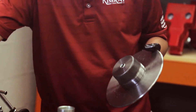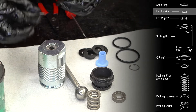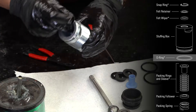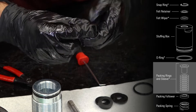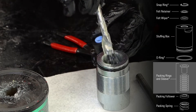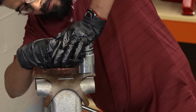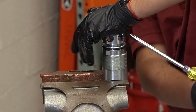At this point, you're ready to reassemble the valve. Start with the stuffing box assembly. Install the felt wiper, retainer, and snap ring. Then put the o-ring on the outside. Slide the packing rings on the packing sleeve. Coat the inside of the stuffing box with grease and push the packing sleeve into the assembly. Next, put in your follower and the spring. With the assembly mounted in a vise, push down on the cage and use a screwdriver to engage the threads. Do not tighten the cage completely — this will allow you to install the trim through the stuffing box assembly later.